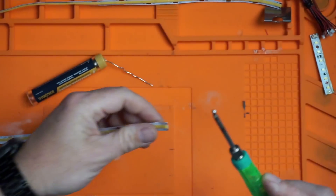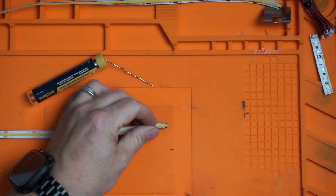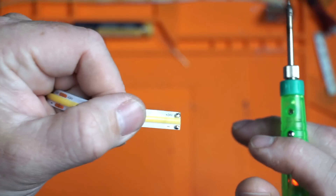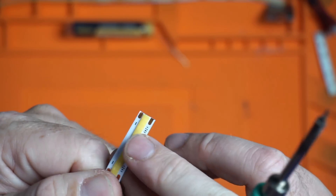Strip the ends of both wires — you've got to do it twice because you've got to do both sides. Now that the wires are ready with the handy wire strippers, it's time to solder. Get a little ball of solder on the tip and go ahead and get that ball onto your LED strip. You should end up with two pretty little beads of solder on there where before it was just raw copper tracks.